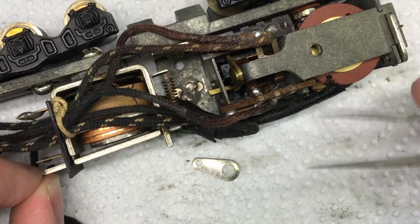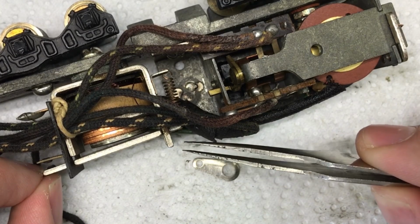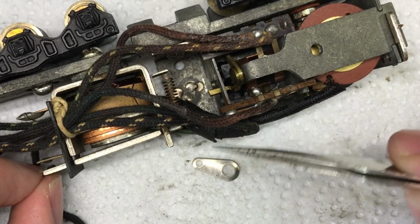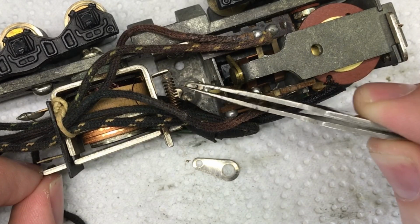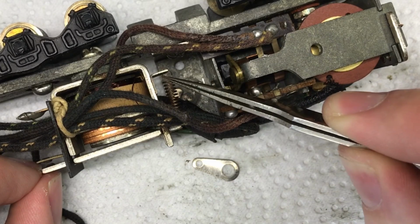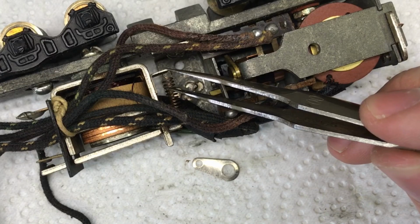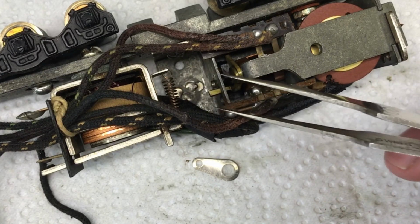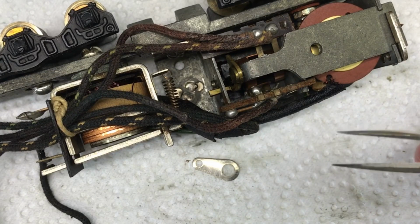This top plate of this other relay solenoid here was not tensioned properly, and I noticed that this spring here had actually fallen off, and also that this bottom piece that holds the spring in place was bent up quite a bit, almost to a 45-degree angle, and then reshaped this with the pliers and straightened it out. And now the reverse unit is clean, surfaced, and operating properly.